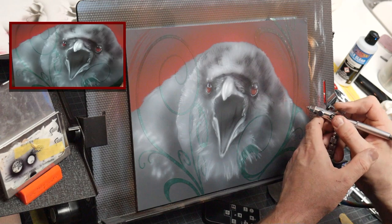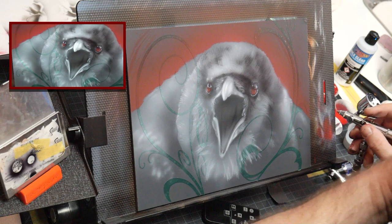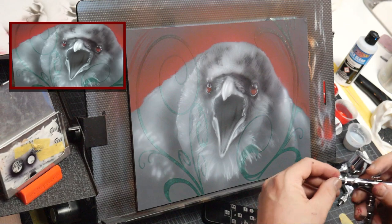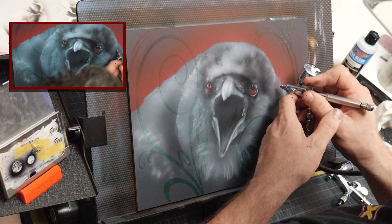Someone asked, are you using the UVLS more than a 40-30? I am now, yeah. I like it better because I'm more used to painting urethanes. It will make the paint dry a little faster and harder. You have less erasability than what the 40-30 would give you. But I just love it because it acts more like what I'm used to, which is a urethane. And it's definitely more durable.